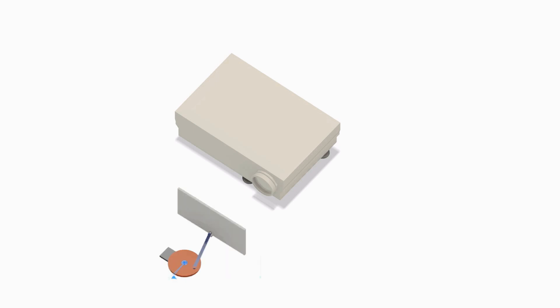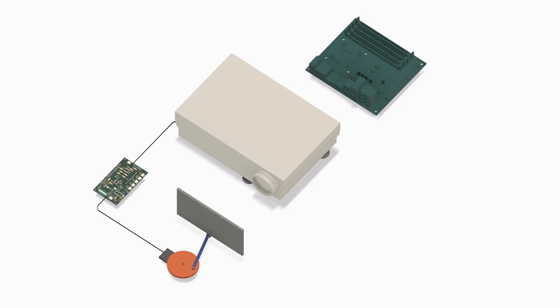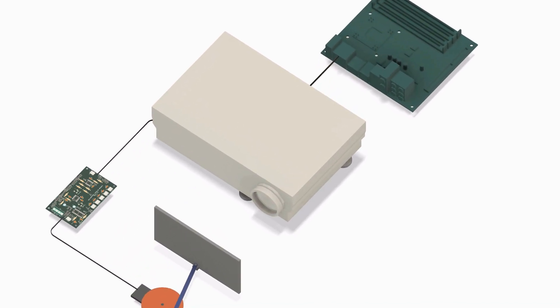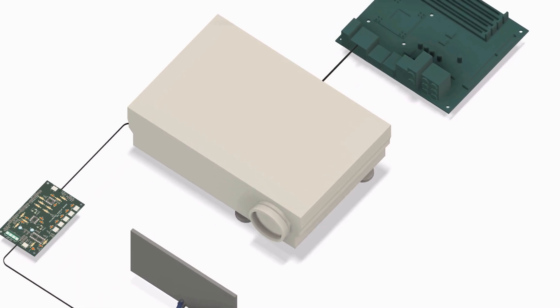The main components of this system are: a projector capable of displaying many hundreds of frames per second, a sweeping projection volume that can be precisely controlled and is fast enough to provide the necessary persistence-of-vision effect, electronics for synchronization and control, and special graphics source and creation tools. We will look at all these key components, but let's start with the most important one — the projector.